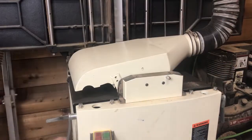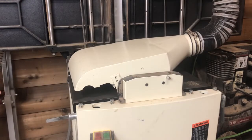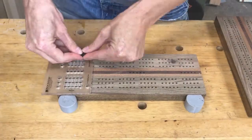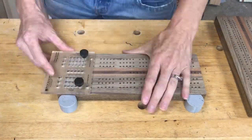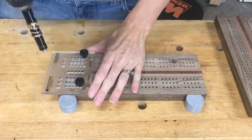As much as I hated to, I took the boards back to the planer to cut them down to just enough to remove the tear out. I then re-drilled with the jig, but since the holes were already drilled, it did not tear out this time.